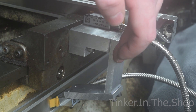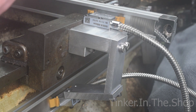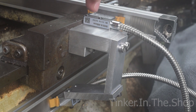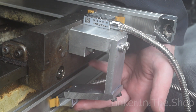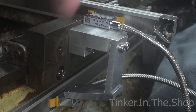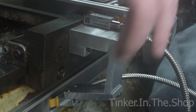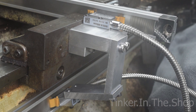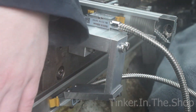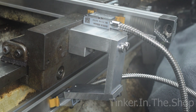I've got these two plates. I went with attaching the Z scale directly to the angle portion of the bed, rather than packing it with an angle packer. This just made more sense at the time. So that's why this part is angled, so that the sensor down here is parallel with the scale. Originally I had this part slightly longer going down, and the sensor was mounted on top. That would be a little bit easier, but because I've got the hydraulic copying attachment, the mount for that has two large brackets at either end of the bed, and this was too low — it was fouling that. So I had to shorten this and put the sensor underneath, but now it clears the full length.